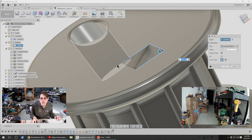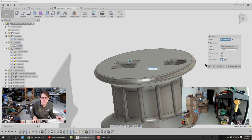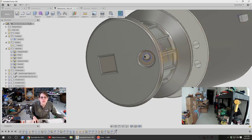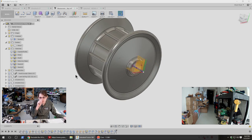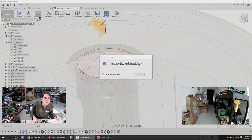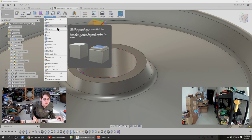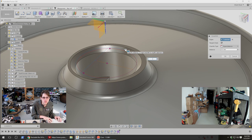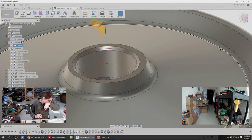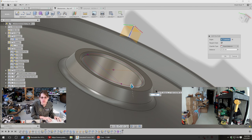Another fillet. .75 is probably fine. Okay, so nut slides in there, screw goes in there, encoder goes in there. Shaft looks like that. I guess this tiny edge here could stand. Oops. I just wanted a tiny chamfer. Tiny chamfer. Just to make it easier to get this in. .25, not 25. Or 0.3 maybe? Sure. That's a little much. 0.2. Okay.